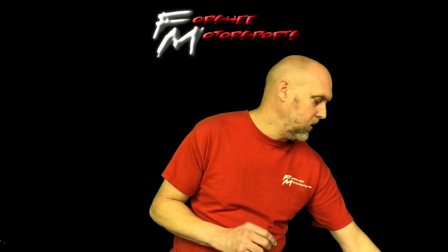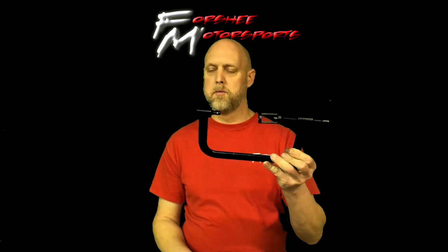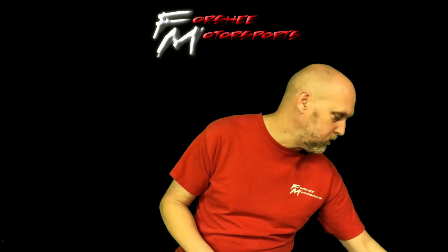Another tool that you will need if you have a 4-stroke bike and you're doing a 4-stroke top end is a valve spring compressor. You can get the valves out of the bike without this, but there's no way to get them back in. You've got to have a valve spring compressor. These aren't too expensive. The dial bore gauge and the micrometers are going to be two of your more expensive items. These aren't too bad. You can pick these up usually about $30–40 for the set. You've got to have it to do a 4-stroke top end.